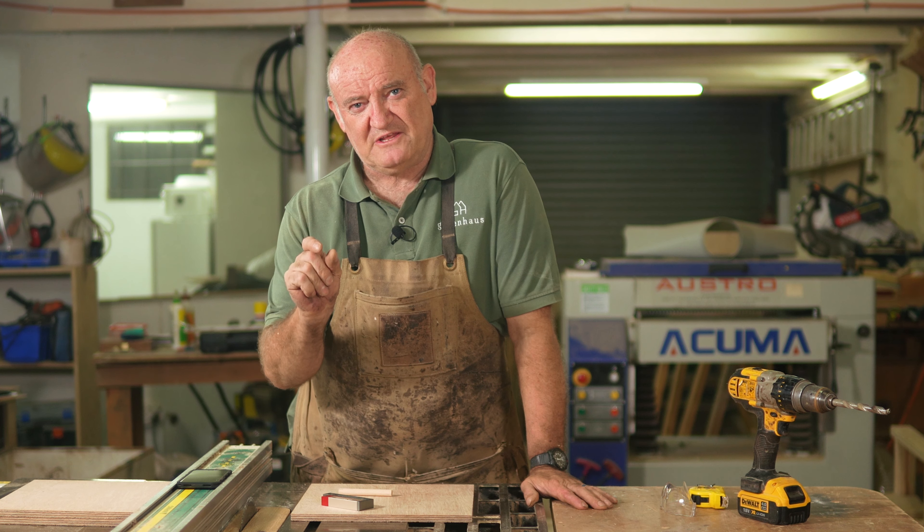We'll bring you in close, show you the components, and we're going to bring out some interesting little tools. We're going to use this guy which is called a kerf maker. I'll show you how it works and that's going to help us cut a perfect size groove. One of the hardest things when cutting plywood is making grooves and dados — we'll discuss the difference. To make a perfect size slot into which you put another piece of plywood is very difficult to get accurate. This cool little tool helps us get a very accurate groove.